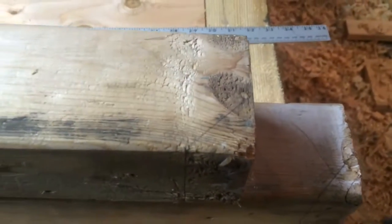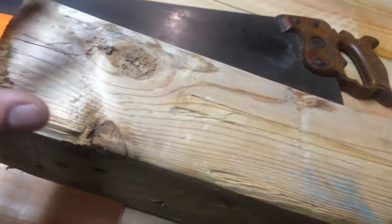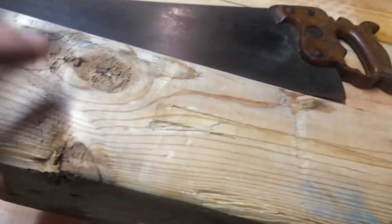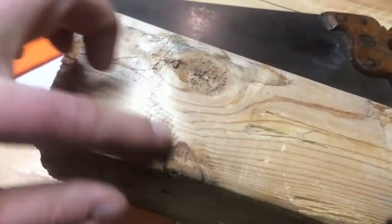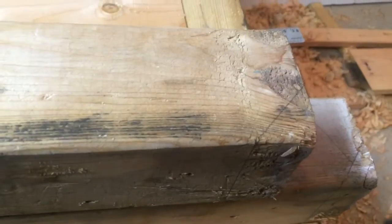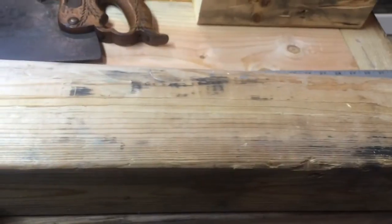Okay, so I've gone through and sorted most of this stuff out. And let me tell you, some of it's a little uglier than I expected, but we're going to make it work. I had to cull a couple of these from being uprights because I'll have to be cutting tenons in them, and I can't have tenons with a bunch of knots in them. So those pieces kind of made the decision for me — I'm going to cut a 45 on them and they will become the base pieces.